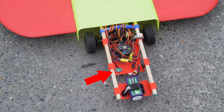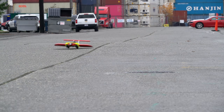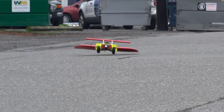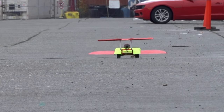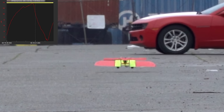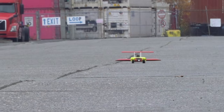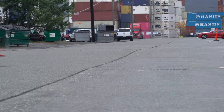It took a little time to get the parameters tuned right, but eventually I got it to the point where it would just kind of barely skim the ground, and at least not fly up like it was doing before. I never really got the chance to fly very far because it was so fast that I could only keep it within line of sight for so long. If I could go back in time I would definitely design this thing to utilize the ram air effect more, where it would behave a little bit more like a hovercraft. I think that would slow it down quite a bit and make it easier to stay in the ground effect.